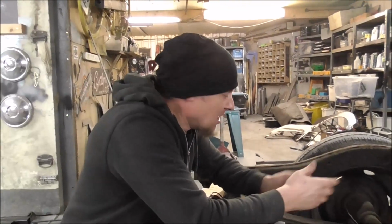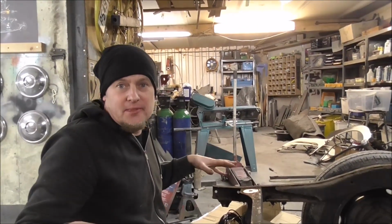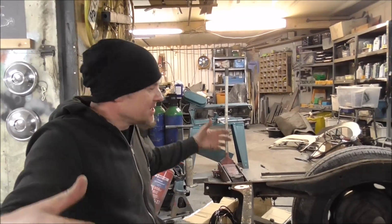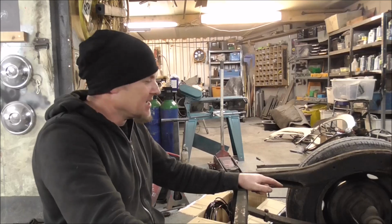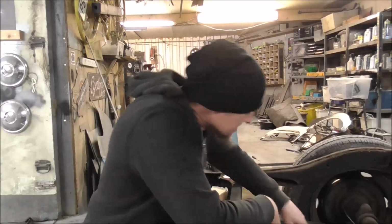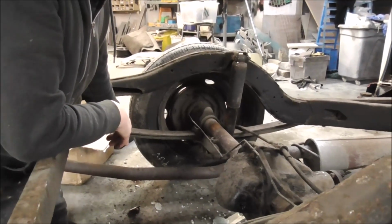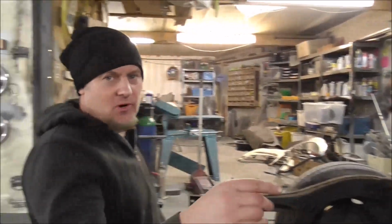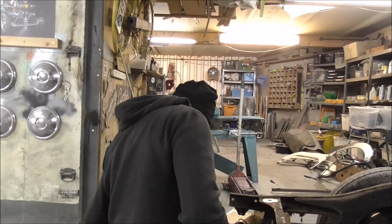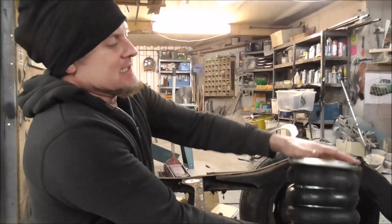Okay then, so this is going to have a lot of stuff on the back, because this is going to be a big van, big jewellery van. What we're going to have to do is beef up this taxi suspension. Taxi just comes with this sort of twin leaf spring, and it's okay, but I've built a van before and it can get a little bit overly wallowy. So what are we going to do to stop that? We're going to fit these airbags.